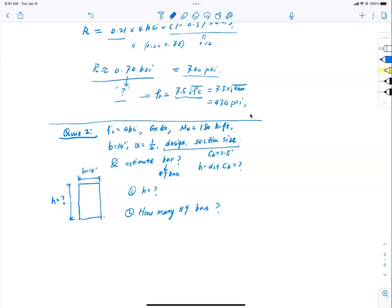So what is omega anyway? Omega is 0.21 with beta 1 over 4, right? Fy is 60, so your rho equals what? 60 ksi divided by 4 ksi divided by 0.21. Oh, the other way: 0.21 multiplied by 4 divided by 60. What is your rho here? 0.0142. And then what's your section? 18.65, so reinforcement As should equal rho multiplied by 14 multiplied by 18.65 inches. What do you have here? Rho, that is this number here.